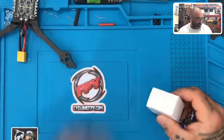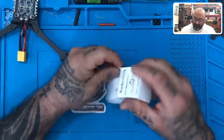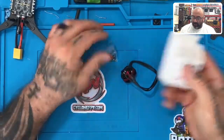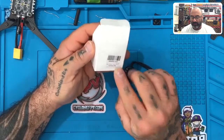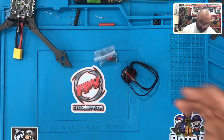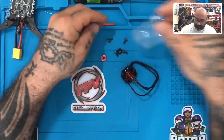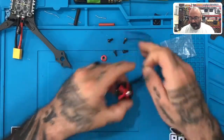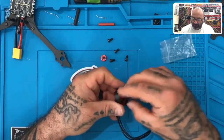Now, we're gonna go ahead and open these motors, and I want you to pay close attention to something here so you don't end up in the position I was in the past. So, opening up, these are the Deadpool 2306 2650 kV motors. These are 4S motors, okay? I'm gonna take the contents out of the box, and then you have this little bag here, right? If you empty the contents out of the bag, you're gonna see you have this rubber ring. Do not lose this. Best way to not lose it is to go ahead and put it on the motor